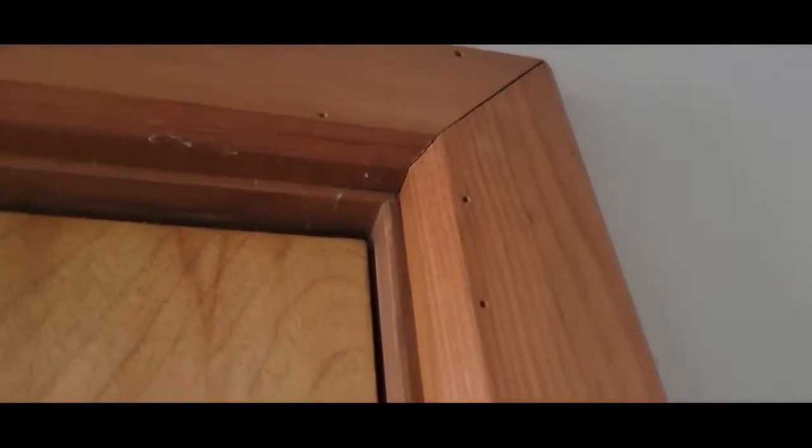These are 2.5-inch wide casings by 3/4, and they're 3/8 chamfer on the sides. So these doors are going to be next to each other. I want them to mimic. And the jamb is going to be 3/4 by 4 9/16. I want to use a 30-inch door so it'll match the bathroom door over here on the other side. And the baseboards, let's see here, these are 4-inch exact, and they're chamfered at the top. And so I want to go out and make enough to be able to do this, maybe some extra in case I don't like the finish on them.